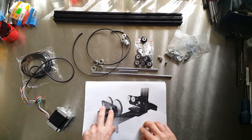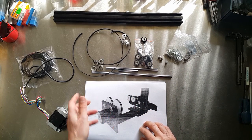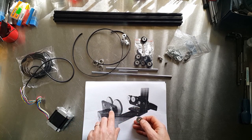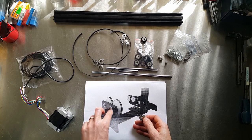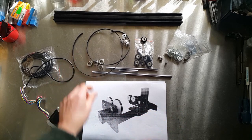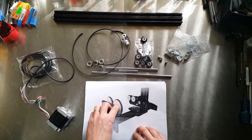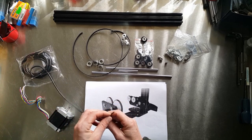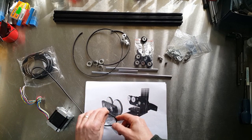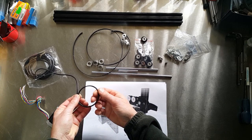The bearings on this version are flanged bearings, but I haven't got any of those — all I've got is some old roller skate bearings, which are going to be ideal. I'm going to make the hole slightly smaller than the bearing and just push-fit those in, which will be ideal for this situation. On the original design they've used O-rings on the wheels, but I haven't got O-rings. I do have some four millimeter rubber belt, so I'll create these wheels, wrap the belt around, and glue the ends together to grip onto the bottle and turn it.